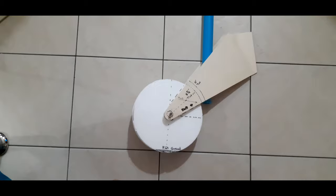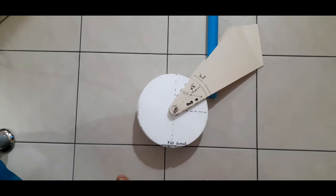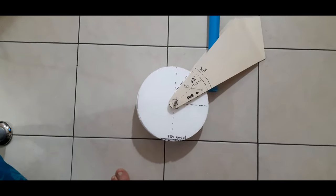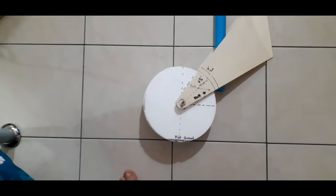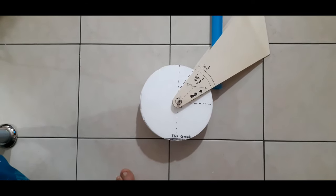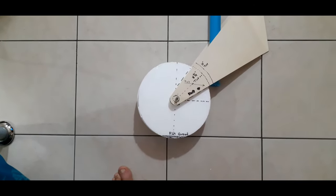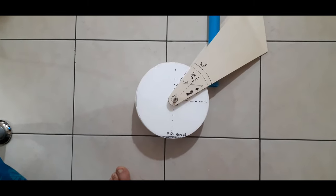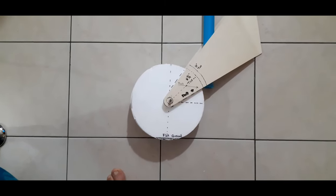So again, the term is castering, and it has a tendency like the trolley carts in a grocery store. Those front wheels caster and steer. So it's the same dynamic. If the wheel's forward of that axis, raked forward, then it has the opposite tendency. This wheel follows the axle, it's behind it, whereas the other one's in front. It doesn't have this self-correcting feature. We'll see how this goes.